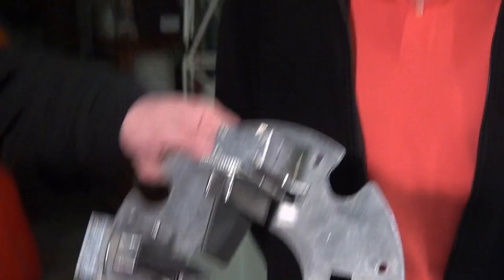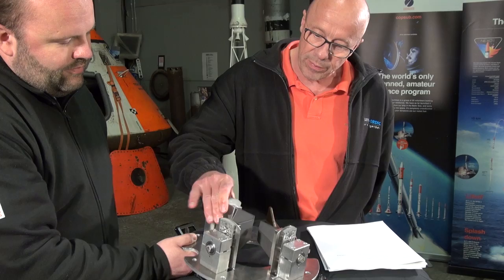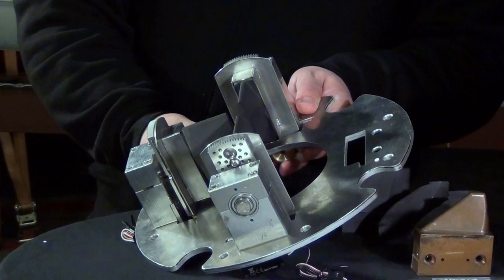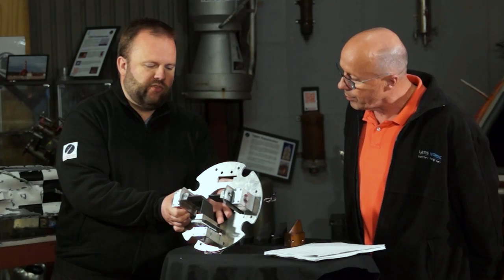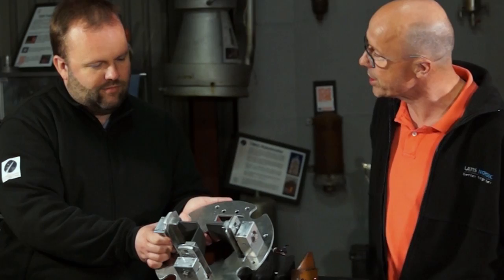So what does this thing do, Flemming? It consists of four vanes — you can see three of them here — and they are all able to move. As the jet passes these almost plain surfaces, the vanes will deflect the jet coming out of the engine, thus providing a steering force which, by controlling all four vanes, can steer all three axes. These are situated right at the jet exhaust — the very nozzle of the jet engine will be around this plane here. So they will take some heat.